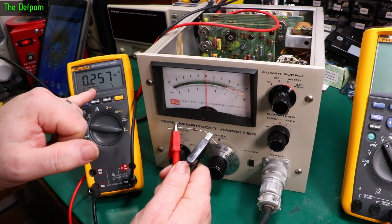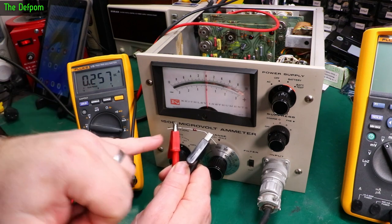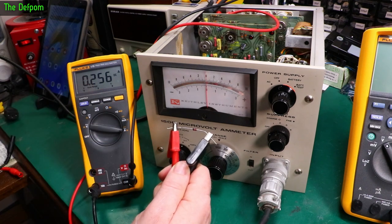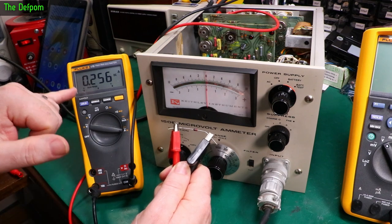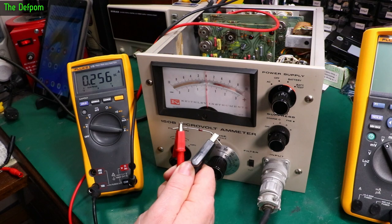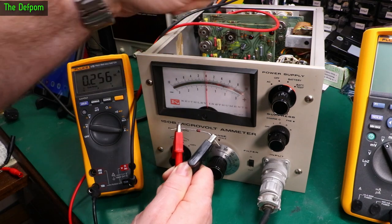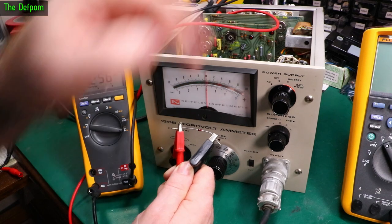But that's only 260 milliamps, so that's the maximum charge current it could potentially put into the battery at 6 volts. That's what that's telling us. So now the current, we know that resistor there is a 10 watt, 56 ohm resistor. But we've got some numbers there we can actually use to do some maths and figure out the voltage drop across that resistor and things like that, and how much power has been dissipated in that resistor.